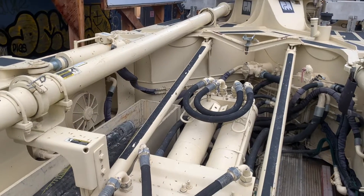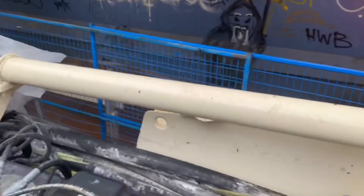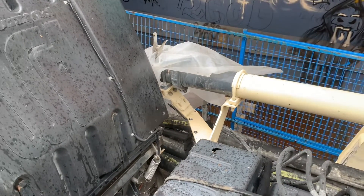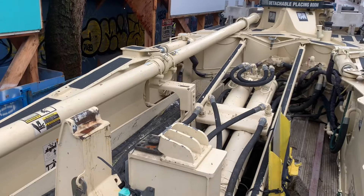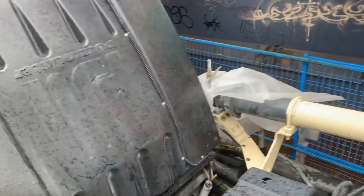It's not just your typical pump where they flip the lines around to the piston side. This thing is actually beefed up so they can pump all day long at max volume and high pressure. It's got the big heavy hopper on it too, similar to the BSA 2110, and big heavy shift cylinders as well. The only major difference with this pump kit is it runs a nine-inch material cylinder versus an eight-inch on most of the BSA series pumps.